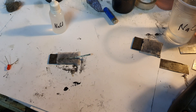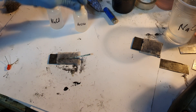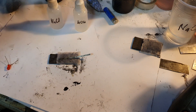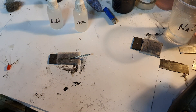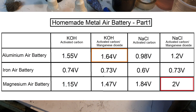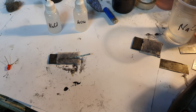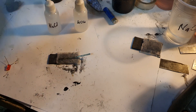So guys, this was the first part of these metal air batteries which you can make at home really easily. The basic electrolytes I used were table salt and one mole of potassium hydroxide — instead you can also use sodium hydroxide. In this video I showed the aluminum air battery, iron air battery, and magnesium air battery. The best voltage and best performance of all three batteries was the magnesium air battery with the highest voltage of 2 volts. The second best was the aluminum air battery. The next three metal air batteries will be in part two. That's it for now, see you in the next video — bye bye!